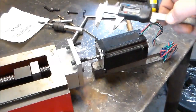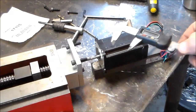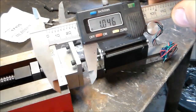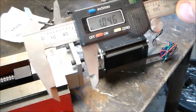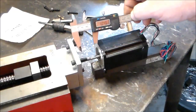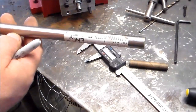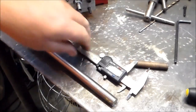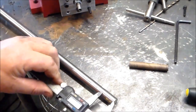I'm just kind of eyeballing it. I'm sure you could buy a motor coupler, but I don't really want to wait. Looks like if I take a piece of one-inch stock I'll make my own motor coupler. It's a piece of oil-hardening steel I bought for another project and we'll use this to make our motor coupling.